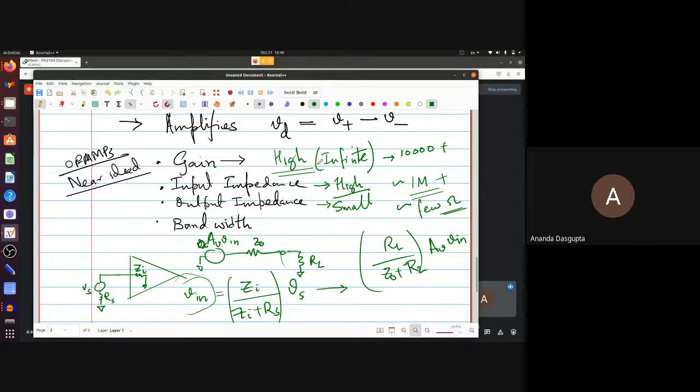But, and this is very important, it's the negative feedback coupled with a huge raw gain, that is, the gain without negative feedback, this huge value, that ensures that once you give negative feedback, your circuit has a very, very stable gain, which is what you really want. So having a huge gain is actually good, not by itself, but because you are going to use negative feedback to stabilize the gain. And once you stabilize the gain using negative feedback, having started with a huge gain is a big advantage. You're going to see that. That's what negative feedback is, one of the major things that we will talk about concerning op-amps, especially when we talk of op-amp amplifiers.